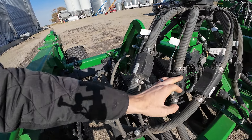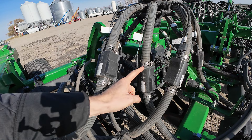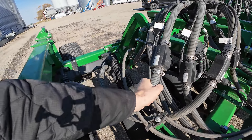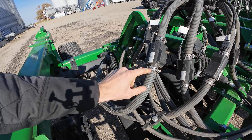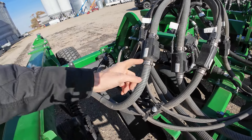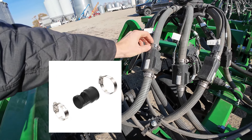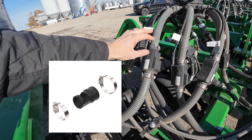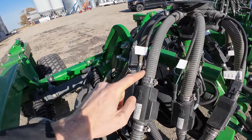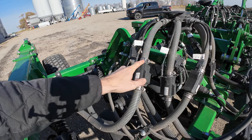This sensor is held on by a hose clamp — two half-couplers essentially, a plastic tube with slits in it to go into the hose. We get some tension and movement and it pulls on this. If it pulls out of this one right here, the sensor still says you're seeding, but unfortunately you're broadcasting — you're not getting it all the way to the row. What we want to do is get a clamp from Air Guard. That clamp is going to hold the sensor to the hose better. You want it down here, not up here — put the clamp here so it cannot release here. It would have to pull off up top.